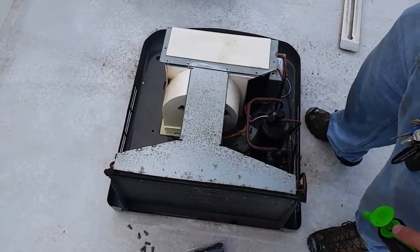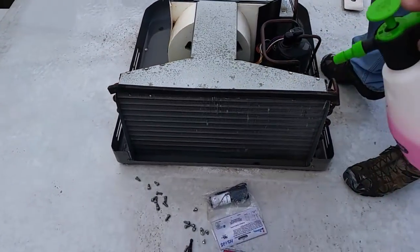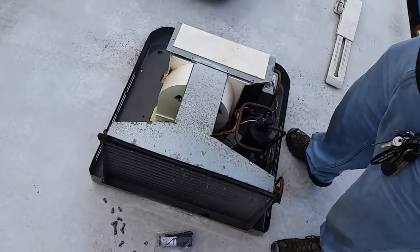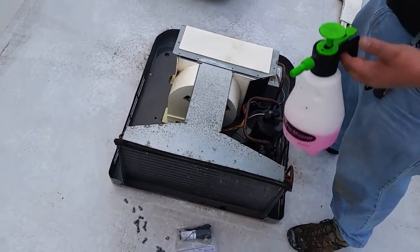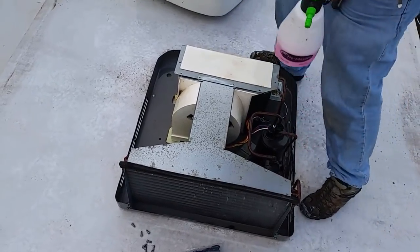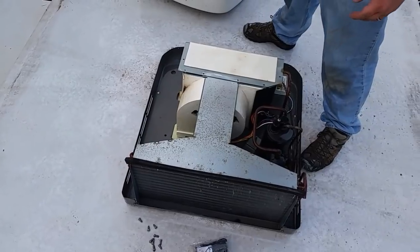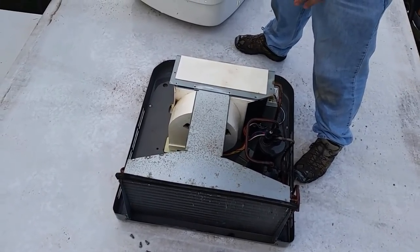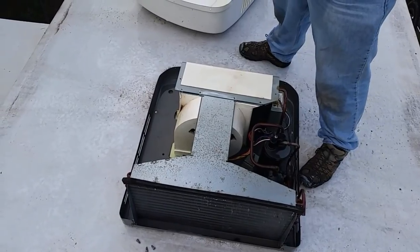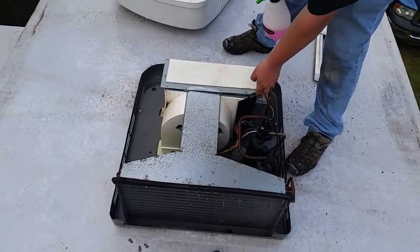I've actually already cleaned the front coils. You hose the stuff down onto it real good, let it soak in, then rinse it off. It's pretty caustic — it was fuming pretty good earlier, but that's all right, it means it's working. You can get this at air conditioner parts and supply stores, or you can get it in an aerosol at a major box store or home improvement store.